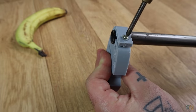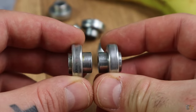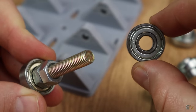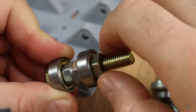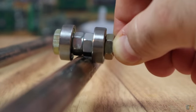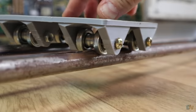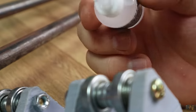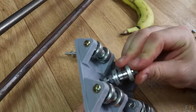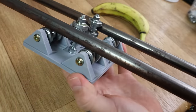I mount the side parts on the two metal tubes and tie the screws so they can't get out. For the slider plate, I've used this type of bearings that I got from old rollers. You could also use normal 22mm diameter bearings with a screw nut in between, so the two bearings would fit on the metal bar with a small gap in between. I've screwed in place the four pairs of bearings — now the plate could slide with no problems. Make sure to add some silicone oil to the bearings so they rotate easily. I then add two more pairs of bearings on the middle holes so the plate won't be able to get out. Now the slider plate is secured in place.